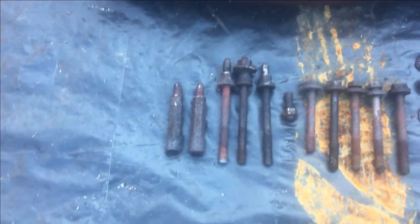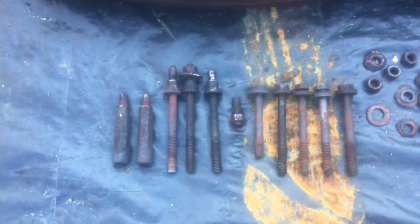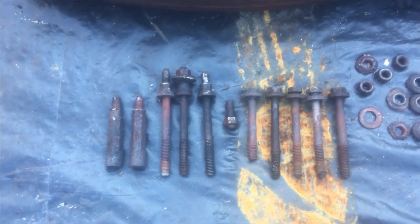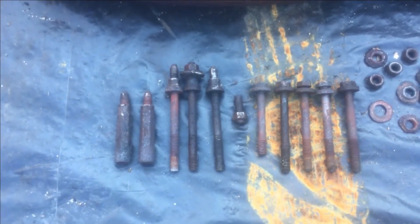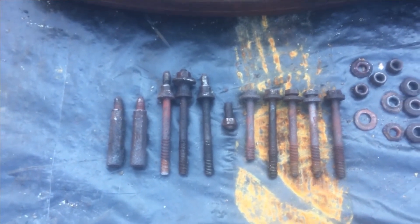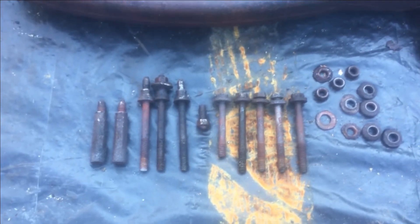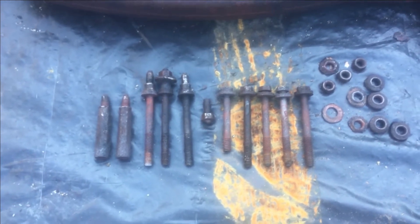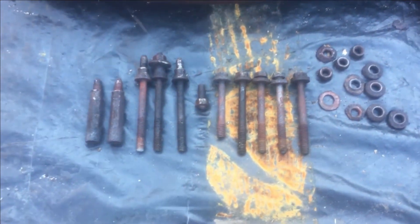They were in such a different state of rust. What I used was, of course, I kept spraying them with the penetrant, and they varied in size because of the rust. So what I did was find the next smallest socket that would fit, pound it on with a hammer, then use a breaker bar. Once I got it moving, just like with a threaded pipe, you go forward, and as soon as it binds a little bit, you back up, spray, go forward, back up, and spray. So it took almost three hours, but I got pretty much all of them out.